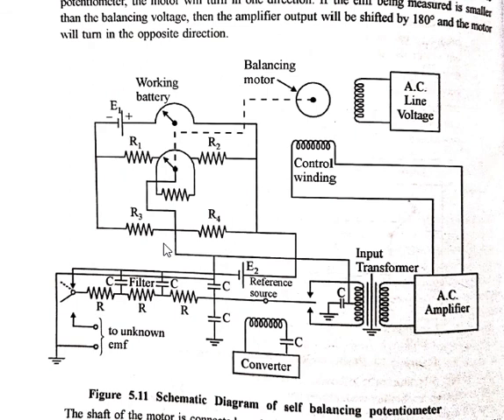The filter capacitors have no effect on the DC voltage supplied to the input, but any rapid variation in the input signal and any stray AC signals that may be impressed upon the input signal are smoothed by the action of these capacitors. This is basically to remove any kind of abrupt or abnormal signals of unbalancing to the converter, restricting stray effects of AC signals from reaching the converter feedback.